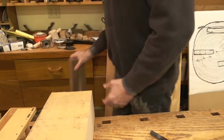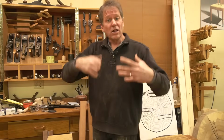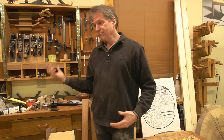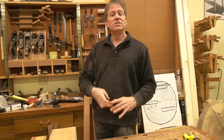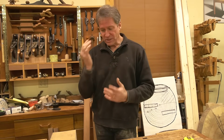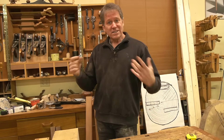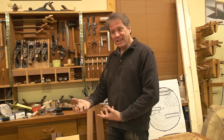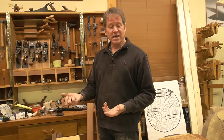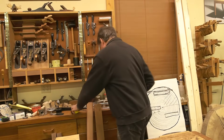Now, with some woods, there's a definite strength factor. I don't know if you've seen, a lot of times when you buy pressure treated wood at the box stores, you look at those and it's very obvious the dark lines are hard. That tends, in this part of the country at least, to be southern yellow pine that's been treated. So you have these dark annual rings for the later growth, and the early growth is wider and spongier typically. So sometimes you'll pick up one of those boards and notice how much lighter it is in weight than one that has slow growth or close, good quality growth rings.